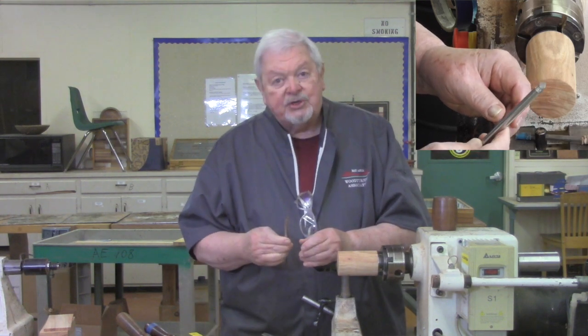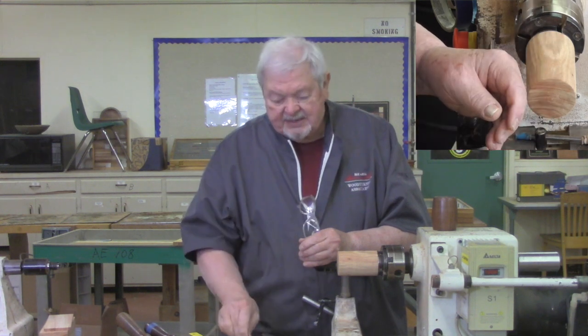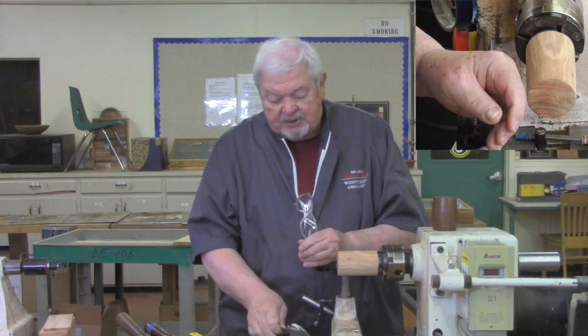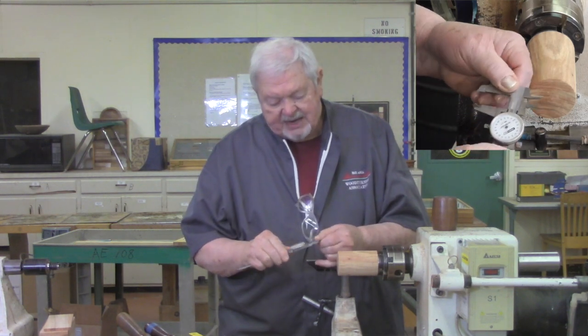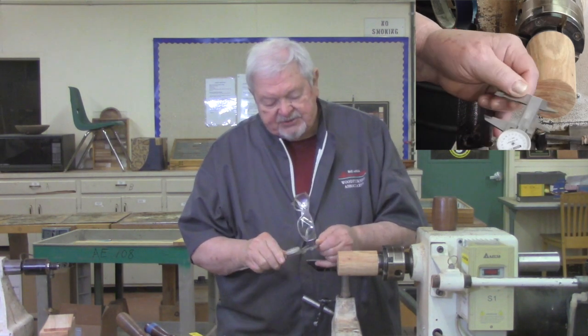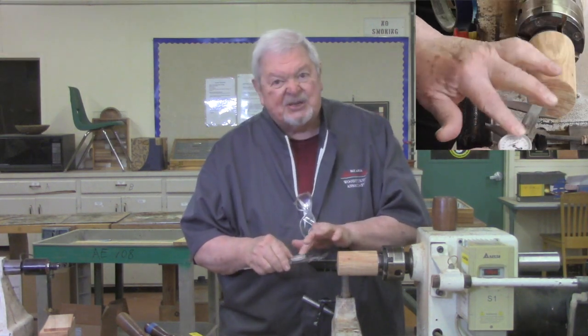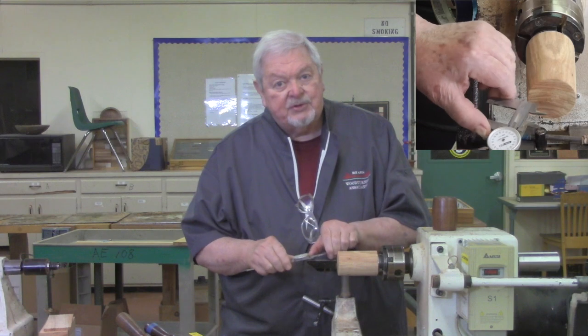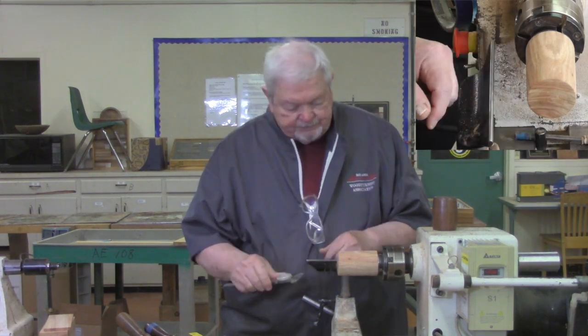My habit is to always do a little decorative mark on the pieces I turn, so I got my diamond point tool. And because I'm always sizing and measuring things, I brought a set of vernier calipers. Basically what I'm using is the inside and outside measurements to transfer. I don't much care what the dial says. I'm not doing things to a specific dimension, although you could.